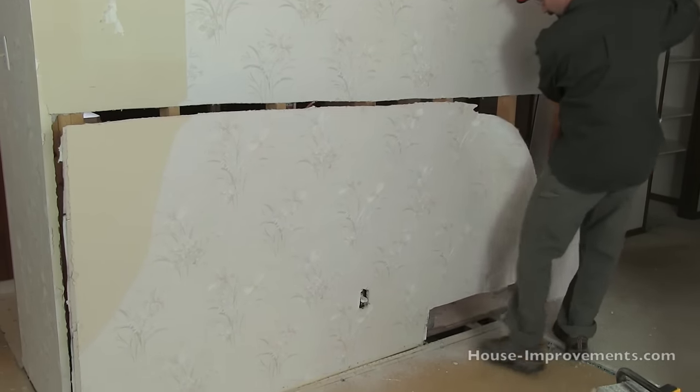As I was doing this, I noticed there are very few fasteners in it. If you look here you can see spots on the studs — this is where they've actually put some beads of adhesive. They held the sheet up with adhesive and then just tacked it. This would have been where the joint between the lower sheet and the upper sheet was, so they put a nail in each sheet, one in the middle, and a few up top — basically just the edges and one in the middle, with the adhesive holding it in place.